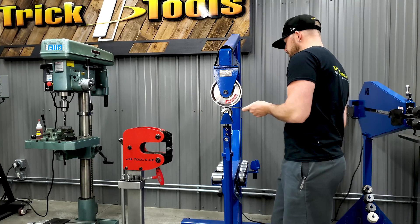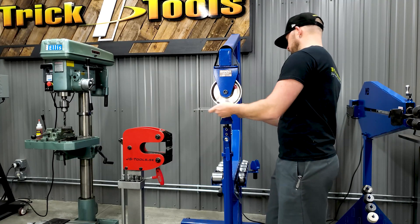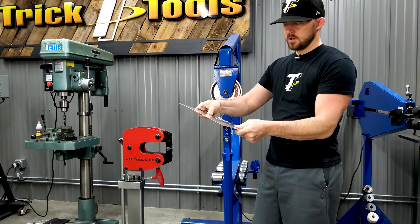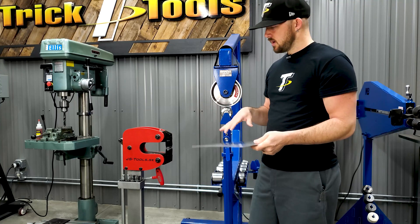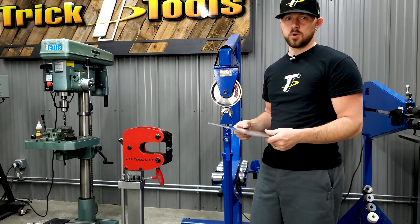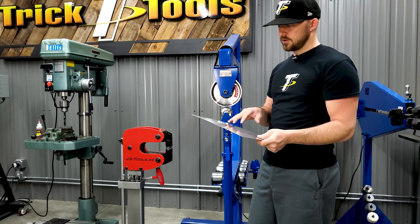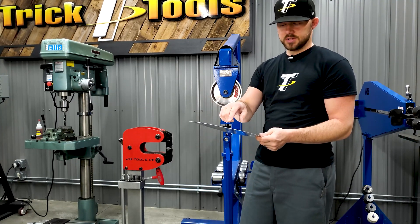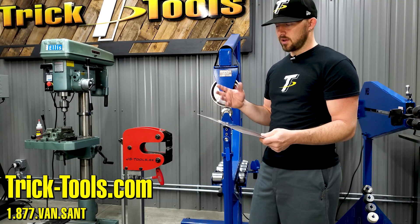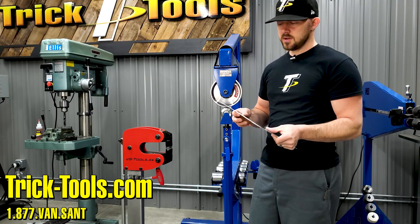After a little more stretching, the panel is now much better — there's a little flex but it doesn't have that wild pop it had before. Hopefully these tips will help if you get oil can in your panels when shaping them or getting them ready to weld. Remember: welding always shrinks, so if you get oil can after welding, you have to stretch that area back out using a hammer and dolly or a handheld planishing hammer. We'll see you next Tuesday.